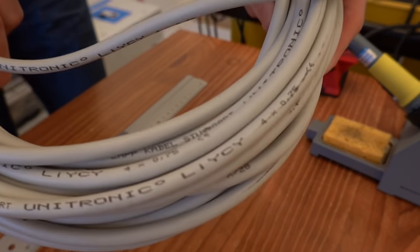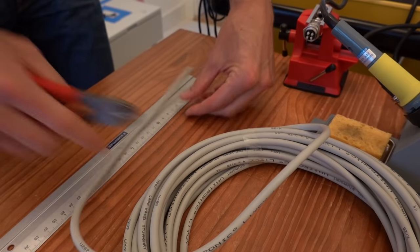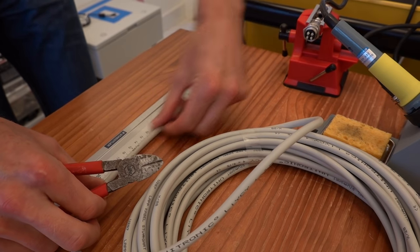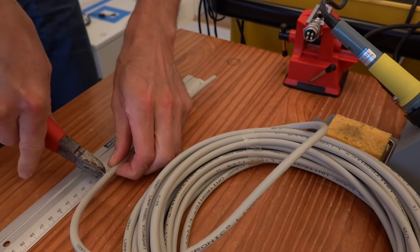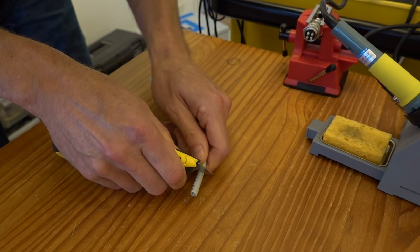Here I am making some of the new wires that will run from the stepper drivers to the motor connectors on the outside of the cabinet. I could have reused the wires from the old cabinet, but these were unshielded, and since I experienced lost steps with that controller, I decided to use shielded cable wherever possible.